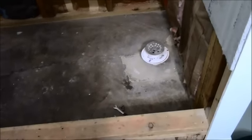And I think I addressed that. If I haven't already, then I will. No, you don't have to move your drain to the center. I'm very symmetrically thinking and looking, and when I see stuff that's kind of off kilter, it kind of bothers me. So ideally, yes, you want your drain in the center. Can you get it in the center if I have a slab? That's more to the point. Yes, you can get it center. As I've already demonstrated, I got it out about 12 inches where it was about 3 before. But you saw the work that I had to go through.